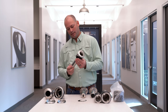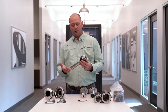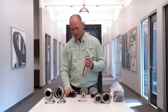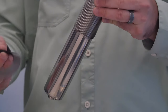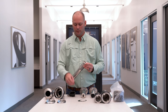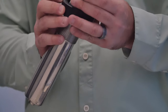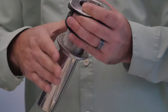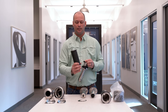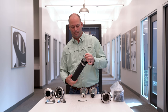You can see right here it's a screwless installation. Basically there's a big spacer, a gasket, and a nut on the bottom side — you install it just like a through-hole. You cut your hole, put your rod holder in there. We supply a gasket with it; that's optional. Some people use the gasket, some people use a sealant. I'm more of a fan of silicone or 4200, but you can use the gasket if you want. The gasket goes on next, then a spacer that comes with every one goes on the underside of your gunnel. You screw the nut on and it sandwiches the gunnel nice and tight. The best thing to do is use one of our installation sockets — they're specific for our rod holders. It just slides under the bottom side, locks in, and it's basically a big deep-well socket. Works really good. So that's our standard size.